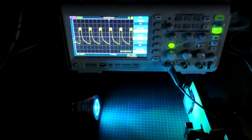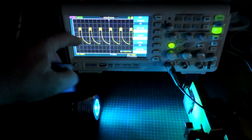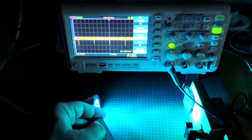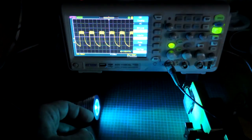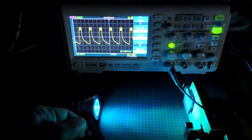The bulb has intensity control via pulse width modulation. You can see some banding on the camera — it's picking up the pulse width modulation as well. As I adjust the intensity, the percentage of time the bulb is turned on varies. That is a very classic way of achieving that. You can see that for cinematography or photography you can't actually use these kinds of bulbs because you end up with these funny banding artifacts.